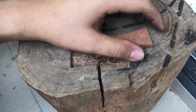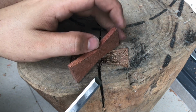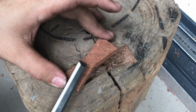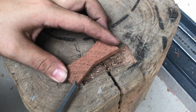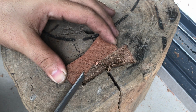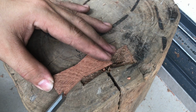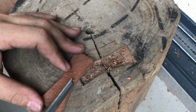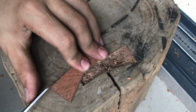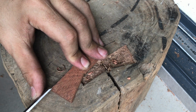So we're gonna prepare the bow tie for entry now, and one of the ways to do that is you could just taper. Okay, we're just gonna chamfer the bow tie very, very slightly. This is the underside. You just wanna peel back somewhere like, I would say maybe a 10 degree taper. It's not a very strong one. Just a 10 degree taper. Just a slight amount there. And that's going to make the entry point a little bit smaller. So that gives you some kind of a lock. And that lock is going to help the material to start entering.